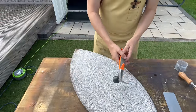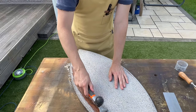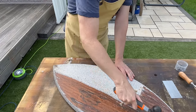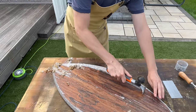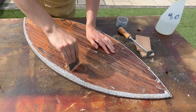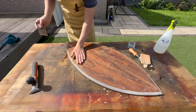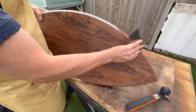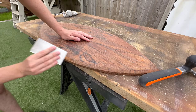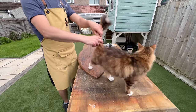Okay, let's take the paint off. I was actually quite curious to see what's underneath — I knew it was some sort of veneer but I didn't know what kind. Because the base of this table is not veneered, it's just mahogany — or actually I think it's a mix of mahogany and sapele — I just wanted to see what I was working with. I used a carbide scraper and a card scraper to remove the varnish and it came off quite easily. I was very careful with the corners because the veneer was quite fragile and lots of pieces were missing, so I didn't want to damage it anymore. When I was done with that, the shop inspector came to give me the initial approval for the project.